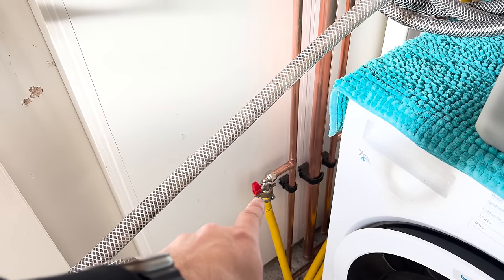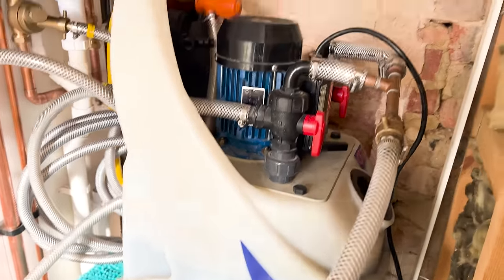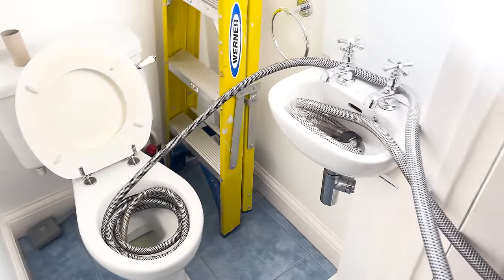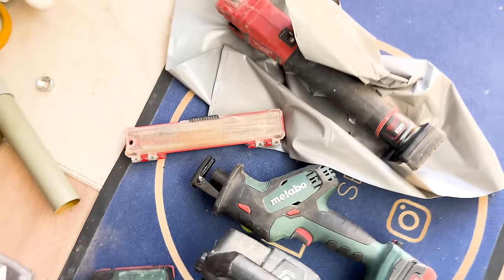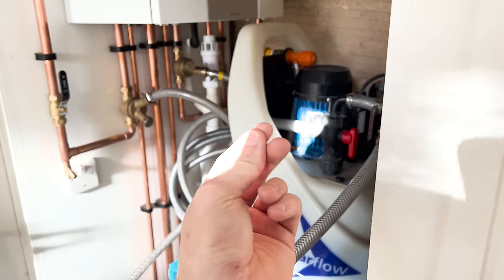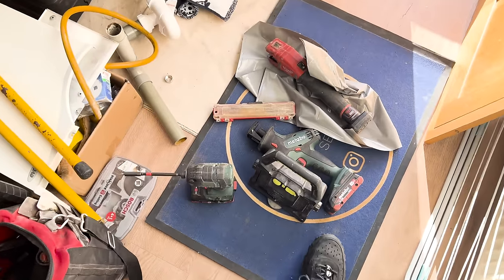I've got a little washing machine valve that I put on, so I'm now filling this up with hot water — 50 degree water, which is a lot better for flushing. The overflow just runs off into a little basin and the dump hose goes off into the toilet, so it'll run away nicely. Whilst that's circulating with the X800, letting it do its thing throughout all the rads, I'm going to run upstairs, take my light up, go into the loft, cut all the scrap up and bag it. I'm letting the cleaner soak — breaking up all the iron oxide and sludge inside the system before we power flush it out. Like leaving it to soak, same as washing up.